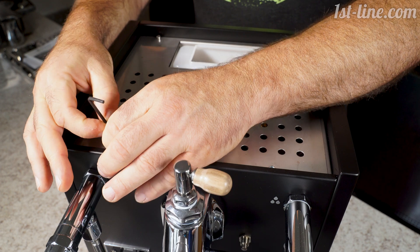As you can see, there's copper tubing and brass fittings. Here's your coffee boiler with a PID sensor. Here's your safety thermostat — there's a safety thermostat on the side of the coffee boiler in case you get into a no-heat situation. Check that, but it usually trips when it gets too hot.